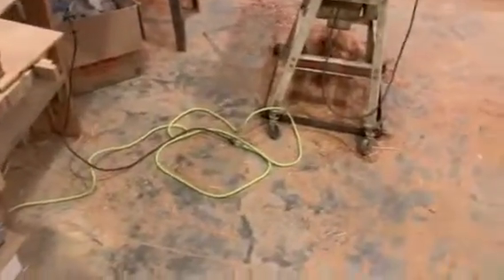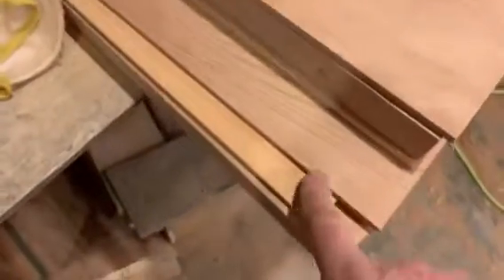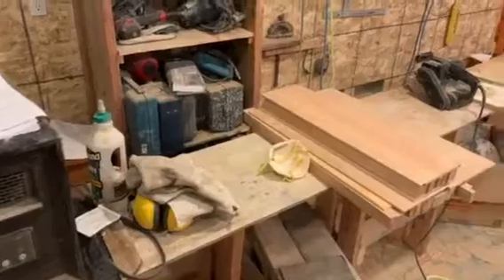That was not jointed. This was not jointed either, but they're good enough the way they are. For my French doors — I've just sort of put those aside — but these are the kick plates on the bottom below the window. I have to glue this veneer on, this one on one side and that one on the other — inside, outside. This is a top rail over the top of the windows. I have to do that on that one plus five more. That's fill-in work when Linda's not able to work with me — this is one-person work here. When we do the stiles as far as gluing veneers on, that's a two-person job.